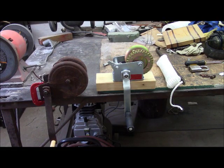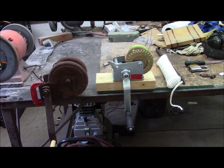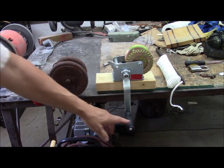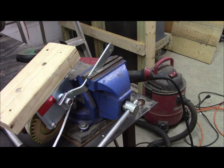I'm going to attach a winch to the crib. So I'm going to go ahead and install this new one here, and we're going to thread it up with this nylon rope and attach it. I'm going to have to put it on another block so that when I rotate the handles, I'll actually have room to clear. Even after rounding the sharp corners of the handle, that handle is still too long to clear the wall, even after I mounted it on the 2x4. So consequently, I'm going to take the angle grinder and shorten it about 1 inch and sight and drill another hole and reattach the handle.